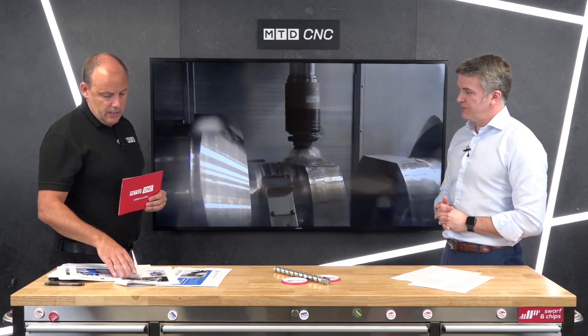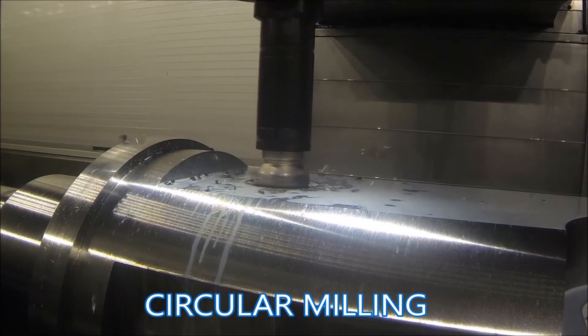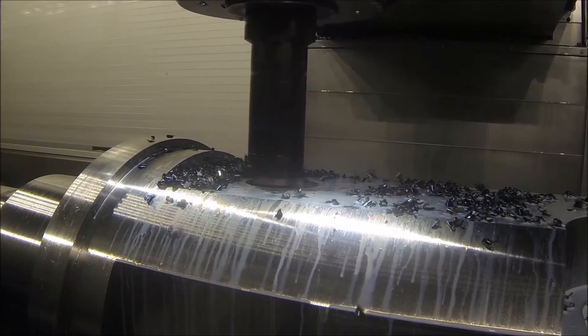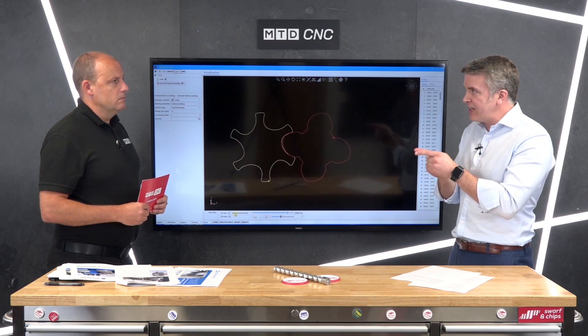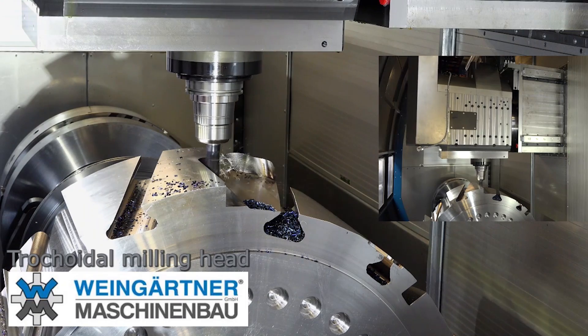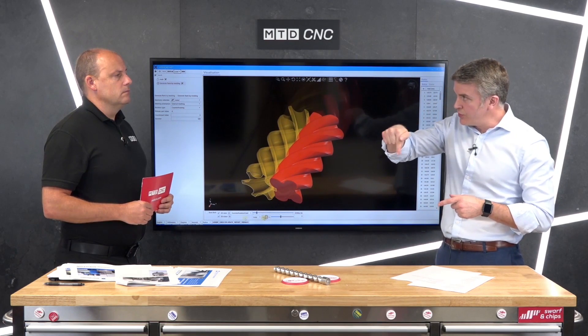Another aspect is trochoidal milling — on harder materials you don't want the column moving constantly back and forth, as that affects the machine's life. Trochoidal milling is fantastically good for tooling and allows you to remove a lot of material very quickly, but if you imagine a machine of this size with its ram and column constantly moving in that motion, that's a lot of wear. So Weingartner have made a head which houses its own three axes inside. It drops off the main milling spindle, picks up the trochoidal head, moves to position — and the column and ram stop stationary — while the head itself does the trochoidal milling motion.